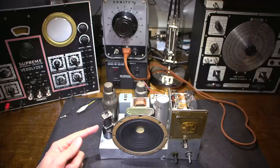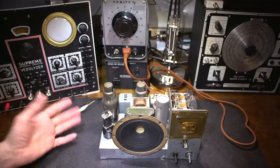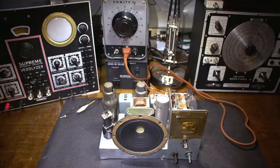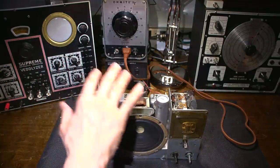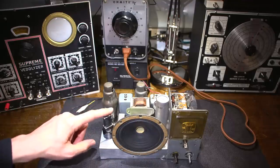You'll notice that the audio output tube is different. I wanted to start this entire restoration off with the tubes that this came with. Now, before this video was even started, and before this restoration was even started, I did an extended troubleshooting procedure on Patreon. And I used the radio itself to test the tubes, and I wanted to show people how to do that. There were a couple of bizarre problems in this radio receiver, and I wanted to show how to find those really bizarre problems. One of them was really unique, in this section right over here. We found that this tube here had internal leakage and it was humming, and we used the radio itself to determine that. So I swapped the tube out and that got rid of a lot of the hum back then. Of course, it had those older filter capacitors in there, so there was still a little bit of hum present. But now with all of these new capacitors and everything in here, it should be very, very quiet. So that's the reason that you see this new tube here.